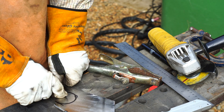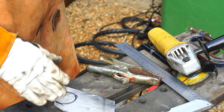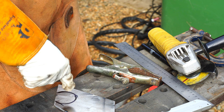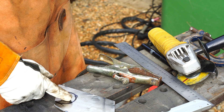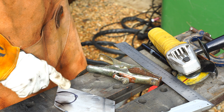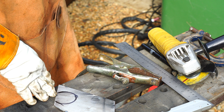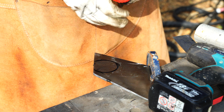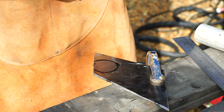We know we need a hole here. You have a few alternatives: you can get a hole saw which is the correct size and drill in here, or you can cut this in half and grind lines with your angle grinder or die grinder and just make this circle - but if you do it that way, keep putting it onto the tube to make sure it's perfect. I've decided to go for a core drill here which is slightly bigger than I need, which will mean extra work afterwards - maybe filling a slight gap - but I can live with that.